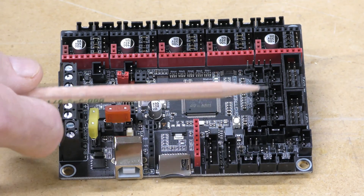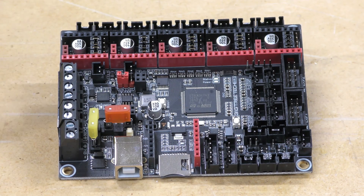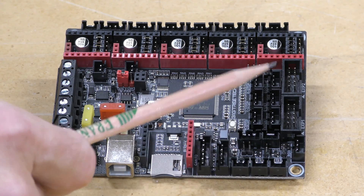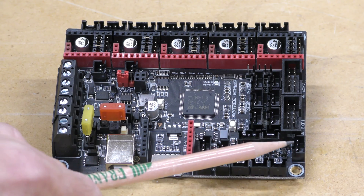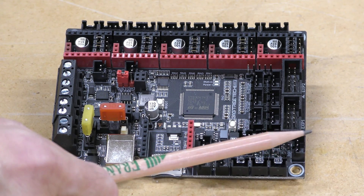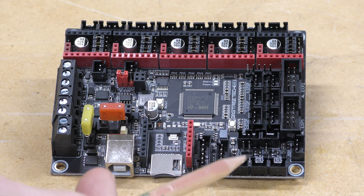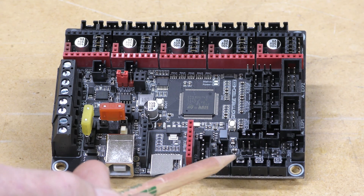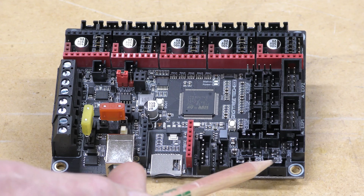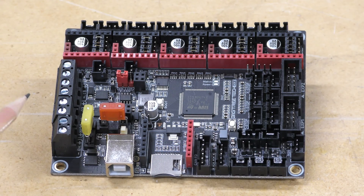There's also a power detection right here that you can hook up to a relay to turn the system off when your print is done. Underneath the limit stops, you've got spots for your BL Touch and also RGB, which is 5 volt — you can also use this for your Raspberry Pi, which is really nice. These three ports here are for your thermistors: one for your bed and thermistor 1 and thermistor 2 for the extruder, again for a dual extruder setup.